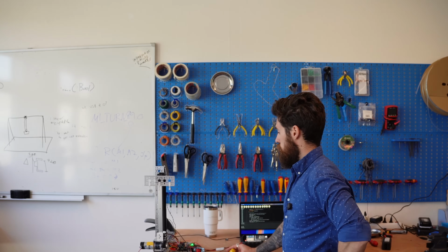Building a linear lift for your robot that never skips a belt sounds like a bit of a dream, but this design makes it reality. In this video, I'm showing you exactly how to construct a rock-solid linear slide system using Misumi slides and belts, featuring a custom motor mount that's so robust the 3D printed mount itself is going to shatter before the belt ever skips a single tooth. I guarantee you that this system will give you reliable, practically maintenance-free linear motion for your robots.